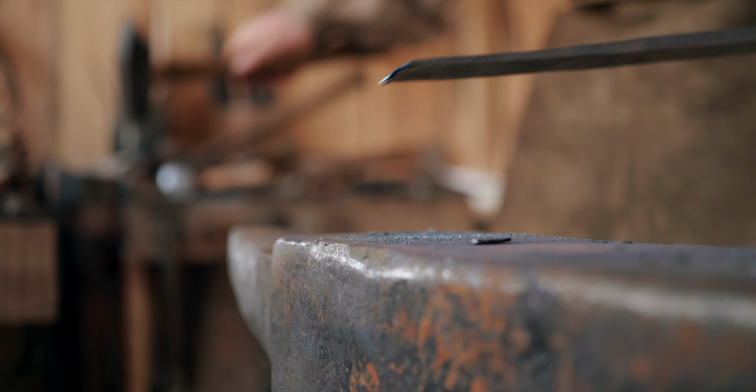And I think it would be great to have it engraved on there, but I always mark mine with chalk because if I'm holding two different measurements that are very similar but not the same, say 2 1/8 and 2, then you automatically, just by a glance, know which side is the lesser and which is the greater.